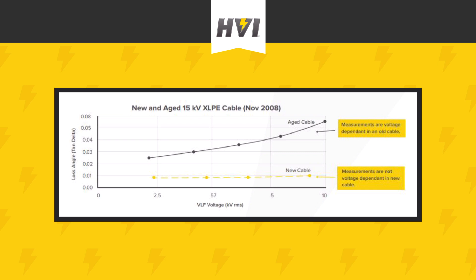In the diagram on screen, two high-voltage cables are tested with a Tan-Delta bridge. The newer cable shows little rise in Tan-Delta values as the voltage increases. The older cable, however, is highly degraded. Just based on that comparison, the operator can immediately begin prioritizing the maintenance or replacement of multiple cables. A key benefit of Tan-Delta testing is that it's generally performed comparatively.